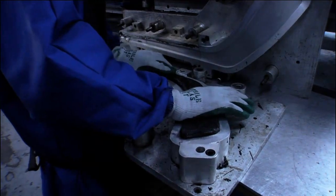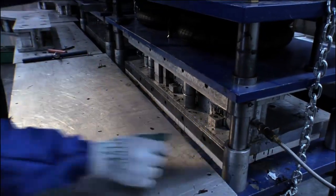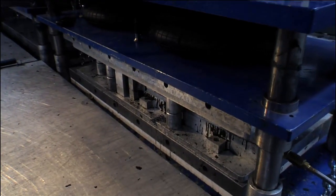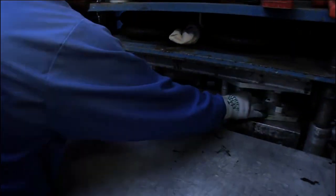So now that preform is ready to go into the mold. The mold is now loaded inside of this press, connected to the air hose, and heat is being applied to the resin system to allow it to cure and set up and attain its maximum strength and toughness. Once the curing cycle is finished, it goes into a chiller press to cool down to room temperature before we extract it from the mold.